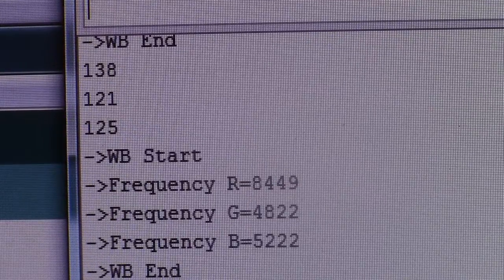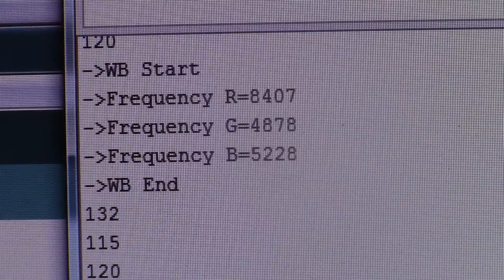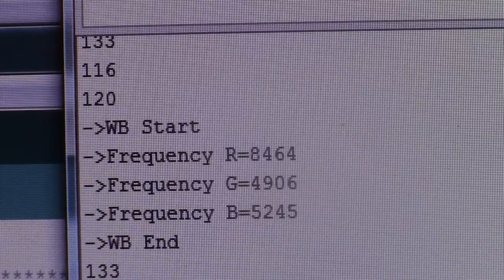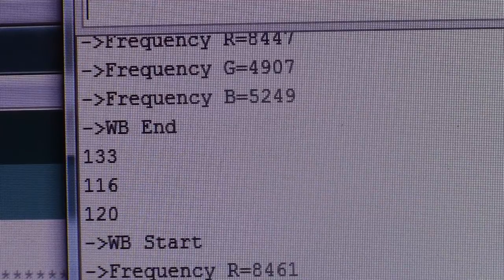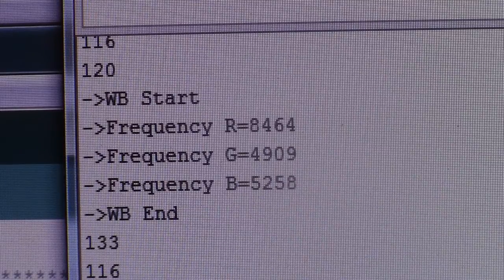Well, I got the battery charged back up, and what I did is I downloaded a program for that OSEPP color sensor, of course, the one we're dealing with, by Elect Freaks, by Robbie W. I downloaded a program that he wrote for the Arduino. Basically what it does is cycle through the red, blue, and green, as I was doing physically with jumper wires. It cycles through with the Arduino pins through red, blue, and green, and then gives you an output.